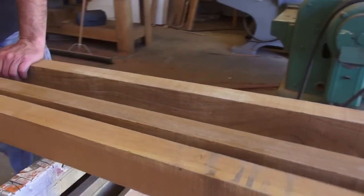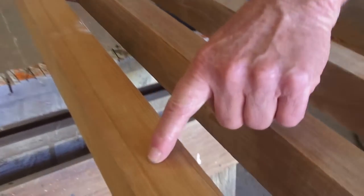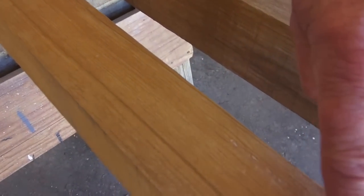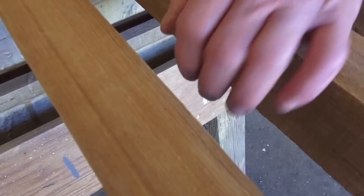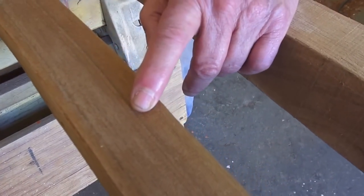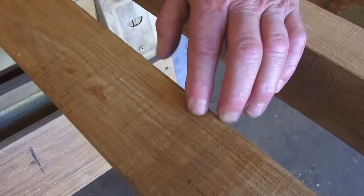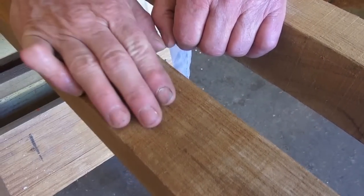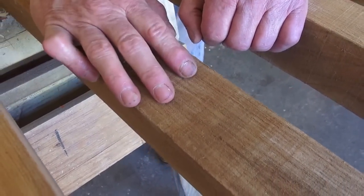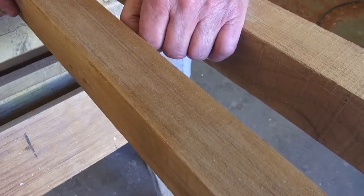Welcome to Teak Talk. This is Burmese teak. You can see how fine this grain is — some places there's 30 rings per inch or more. In fact this one you can't even count them. That's what you're looking for. If you turn it 90 degrees you can see the flat grain. You don't ever want flat grain facing the sky because it will lift, it will warp, it will cup. You want vertical grain — that is, the grain going this way, also known as quarter sawn.